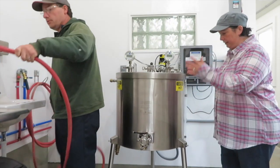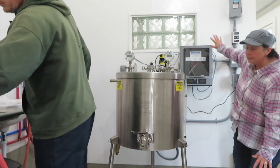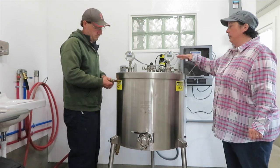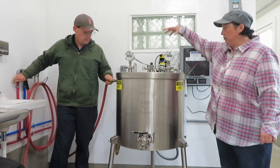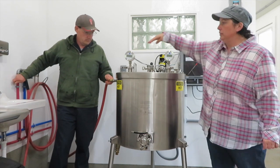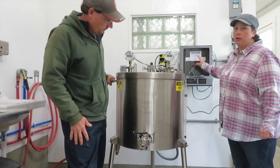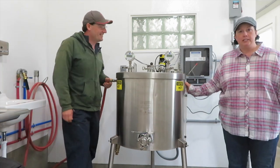After we got everything in here, Stacy finished doing all the electrical work. The way the vat pasteurizer works is you have a jacket around it, and then the product — in our case milk — goes in the center. The jacket heats up. You have all these temperature gauges, and then you'll have a piece of paper in here that will keep track of all the temperatures to prove that you can pasteurize. This is very scientific, y'all — pay attention.